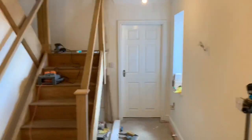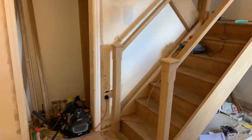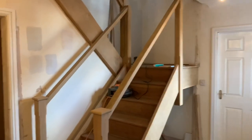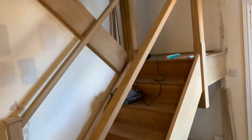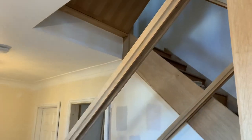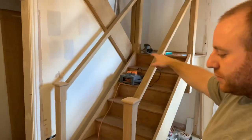And hopefully, I'm not sure what to expect. As I've said previously, this is the first time doing it, but hopefully it will improve the finish. So what we're going to do is, it's going to be a much quicker job. We haven't got all the nooks and crannies to get in really, but we need to get all this up here done up to the first floor. And we'll do that with the 120 grit. I'm using the orbital sander still, and the Ryobi multi-tools come in handy as well. I'll go through the tools at the end of this.